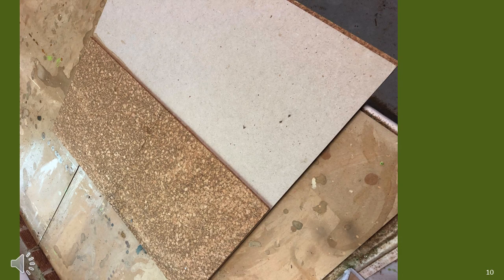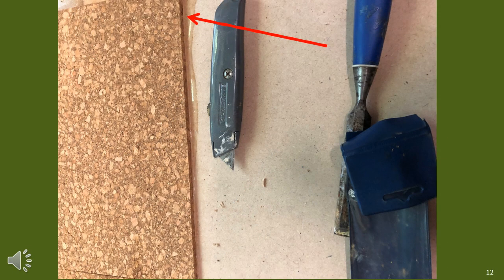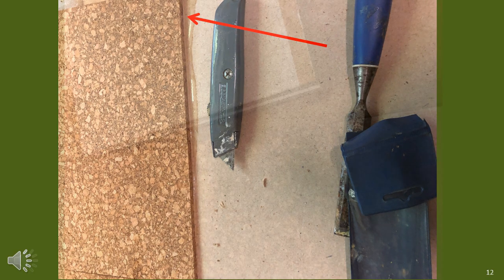That's my advice. When you do glue the tiles, always make sure the tiles are firmly held down by weights. You do not want a tile lifting at the edge. This is the real reason why you should glue all 4 tiles in a single session. If you only glue 2 tiles, there is a risk the glue will ooze out, and this will need to be cut away with a knife and chiseled in order to allow the other cork tiles to butt up against these, as I discovered, and it was a very painful exercise to fix this.